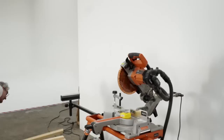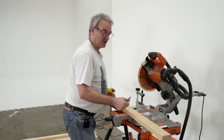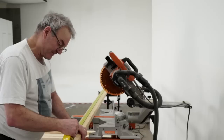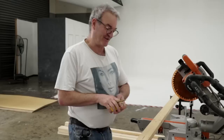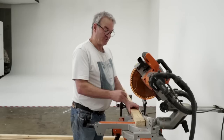These walls are gonna be 2.4 metres high. These are the uprights, so they need to be less the twice thickness of the top and bottom plates, which comes down to 2.33 metres. I would have got Bec to do the maths but she's not really good with numbers. I'm going to mark them all at that length, cut this one, and Bec has to do one of each thing. I'll get the nail gun — the little pop one, not the big bang one.